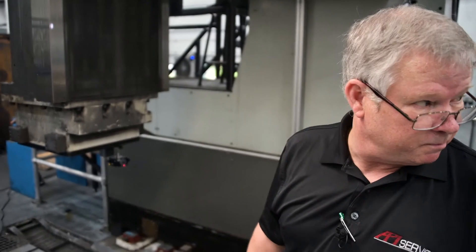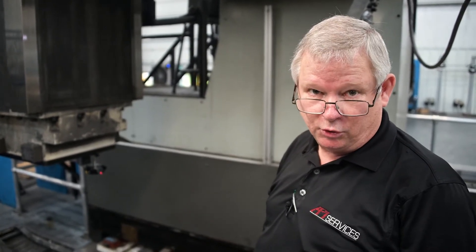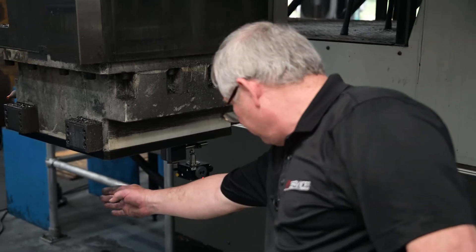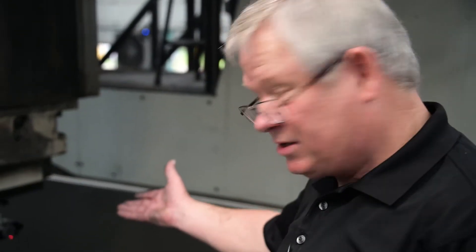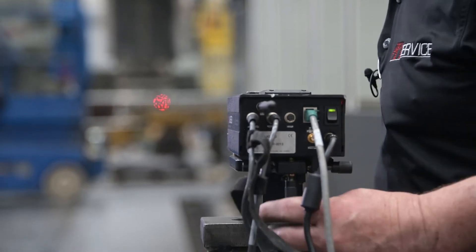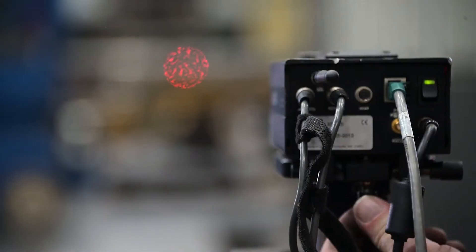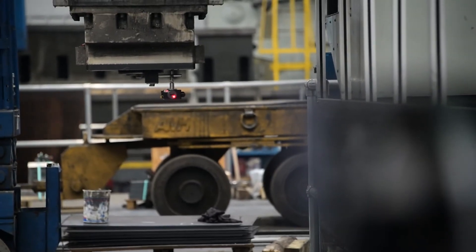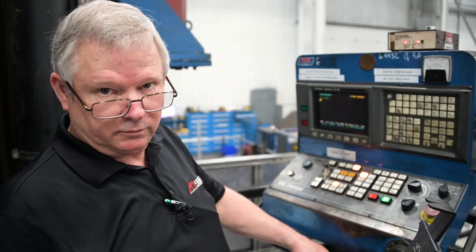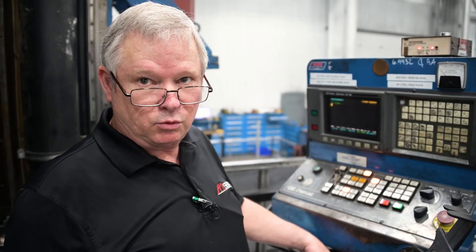It looks like I got pretty lucky. This machine that we're going to be measuring is just under 12 meters. By setting the XD laser up at that end with the sensor real close, it's really hard to get your angle exact. You can see the laser beam is right there — normally it could be off anywhere. Being I'm pretty close, we're going to go back to the XD laser and fine tune it to bring our beam in right to that mirror. These are our fine tune knobs on the back of the laser — this one goes up and down, this one goes side to side. We want to move it up and pull it back just a little bit. We're going right back to the start point, the most negative end of travel, and we'll readjust to get the beam back in center again.